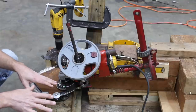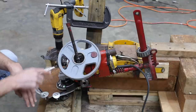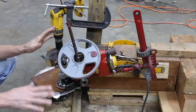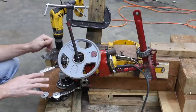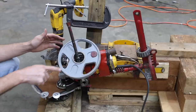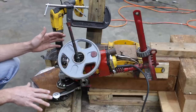The only way to get fair and accurate testing results is to take humans out of the testing process as much as possible. I've got a grinder on a pivoting arm that moves freely and I'm going to plug this thing in to start the test and unplug it when the test is over. We have five pounds of weight on top of the grinder. I've done some testing and five pounds seems to be the right amount for the 3/16 inch rusty steel. This is the first test. In the next test we're going to actually increase the amount of weight and the amount of time.